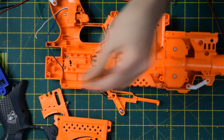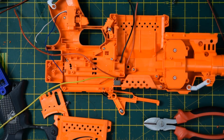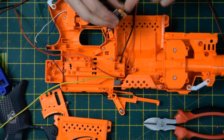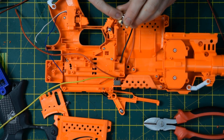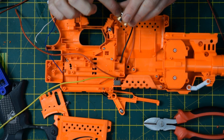Now, the board itself necessitates a slight change in how we do MOSFET wiring. But you'll notice it's got the diode on board already, which addresses one of the biggest complaints we used to get from people with MOSFET builds, which was locating the diode correctly. You've also got the resistor, as I say. These blank pads here are for a stabilizing supply capacitor.